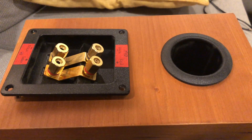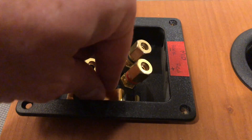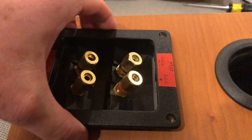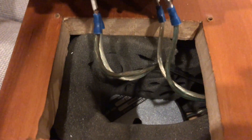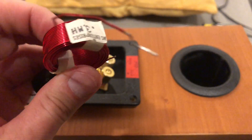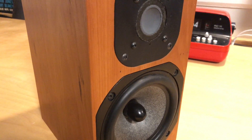The first thing I needed to do is get the speakers ready to be used with the Symphonics. You'll see on the back that I had these set up to be bi-wired, so you can see those jumpers between the two terminals — I can remove those. Then I basically just straight-wired from the back of the terminal to each driver, so there's a direct connection from one terminal to the tweeter and the other terminal to the woofer. As part of that I pulled out the hi-fi first-order crossover that I had in these boxes, so at this point they're super simple — just the woofer and the tweeter with individual binding posts.